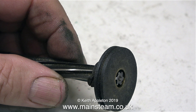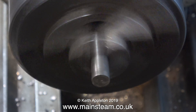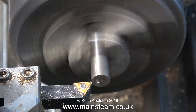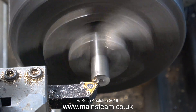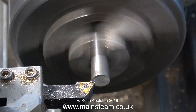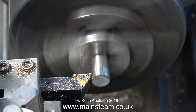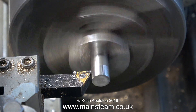This pulley is a mess. The only thing that's accurate on it is possibly the hole in the middle — I'll take it from there. The first thing to do is to make a mandrel in the three-jaw chuck. I'm not going to use any collets because I'm not happy with the ER40 collets I have, and it's easier to do it this way. I've put a piece of steel in the chuck that's oversized and does not fit in the pulley, so I'm going to turn it down. It's most important, once I start this job, not to remove it from the chuck.